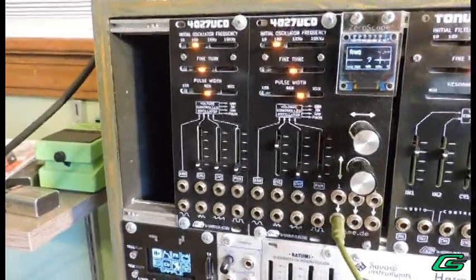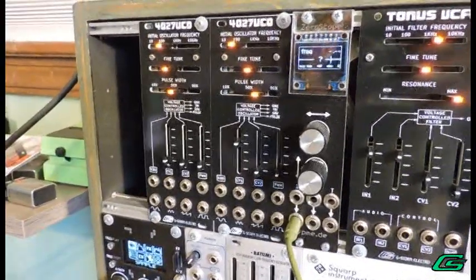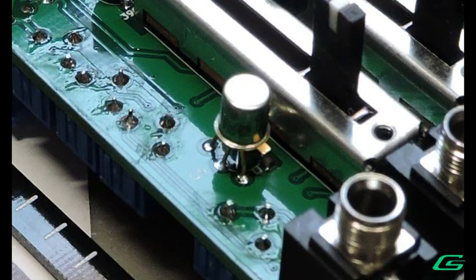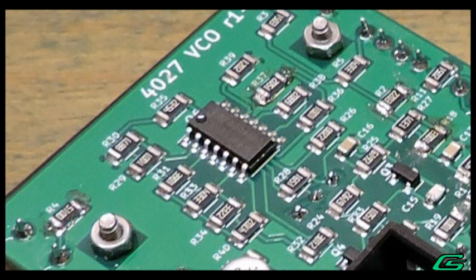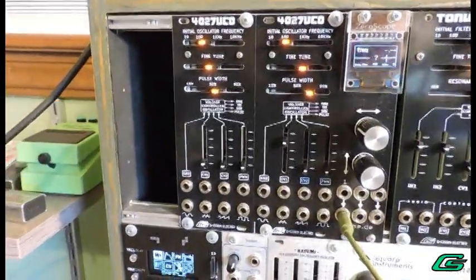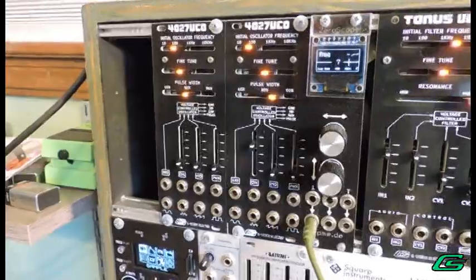Bringing that special tone to life, the 4027 VCO keeps the circuit as close to the original as possible. A matched and thermally coupled transistor pair, a temperature compensation resistor for tuning stability, a low ESR styrene capacitor, an InterFET premium dual FET can, 5NPN monolithic substrate transistor array, precision tune and tracking trimmers, and the 70 spec op amps are still in production today. You didn't need to know all that really, but I just wanted you to know how much work and how many parts are going into this project.